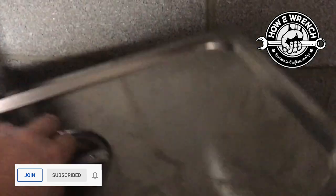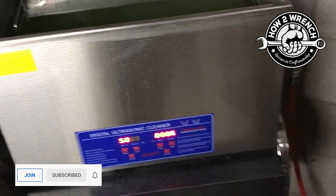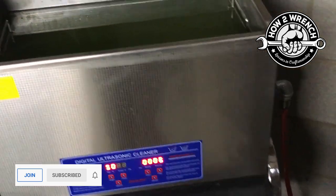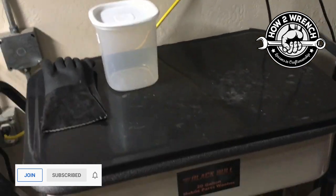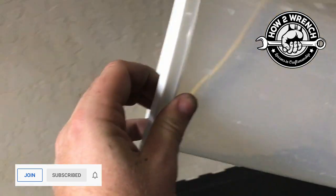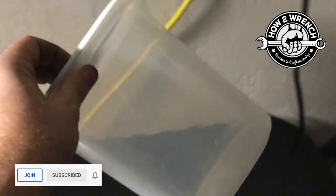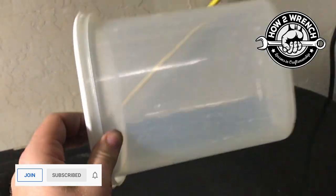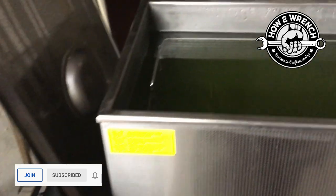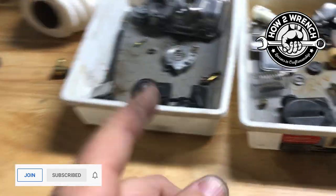You do not want those ball bearings falling to the bottom of the tank without you knowing it. That's another reason I really like these small tanks — you can drain them between jobs so you thoroughly know there were no extra pieces in there. If you fill the solution in a bucket or container, and you did have any balls or springs fall out, they'd be captured there — that's a really fast way versus draining the whole tank.